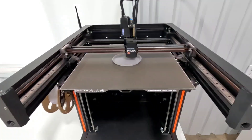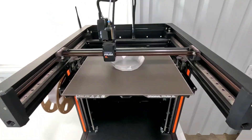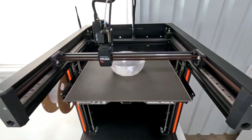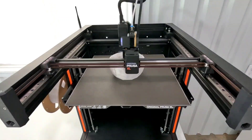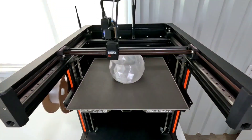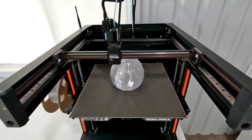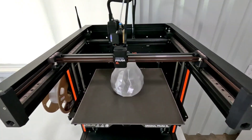So I pulled it into Tinkercad and messed around with it a little bit so that it would be a little thicker. It's not going to be printed in spiral vase mode — it would be closer to the origami planter where it's going to be a little bit thicker. I did set the seam as aligned. I was hoping that would still look really nice with this design. I printed this at 0.2 layer height and it took about six hours. Keep in mind this is not a very large vase — it's about five and a half inches wide and about seven inches tall.